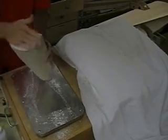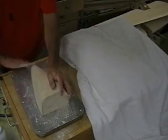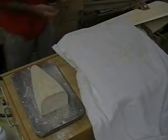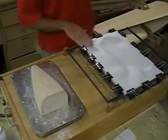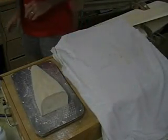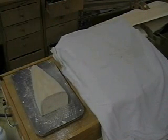Especially with a deep draw like this, I sometimes have to cut the end of the thing to get them off. I've got that prepared and sanded out — now it's just a matter of waiting for the plastic to heat. You can see it's got a wrinkle to it; it'll continue on but it's still pretty hard and you can burn yourself easily if you touch it. I'll go ahead and let that heat up, I'll cut this tape so we don't spend all our time waiting, and I'll come back right before I'm ready to pull.